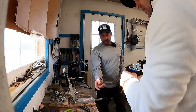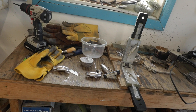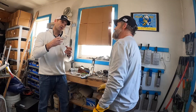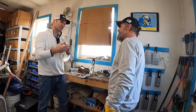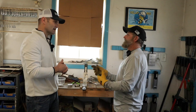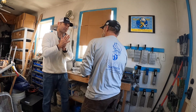We're going to take our mold. The one we're going to use today is an eight-ounce spire point jig head that's been modified so that I could put a pin through there to make a hole all the way through the lure, so that our leader can slide through it. When we're offshore, that's what we need. Whereas trolling for rockfish, the hook is actually inside of the lure head, and it's molded that way. These, we want this lure to slide up and down your leader.